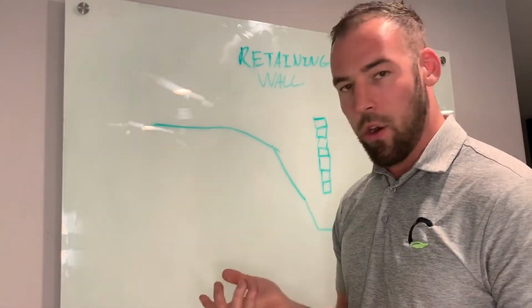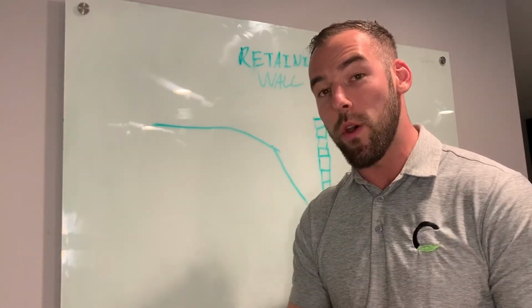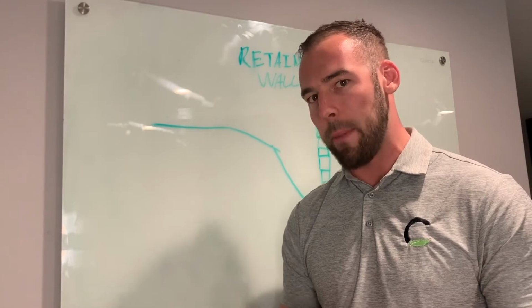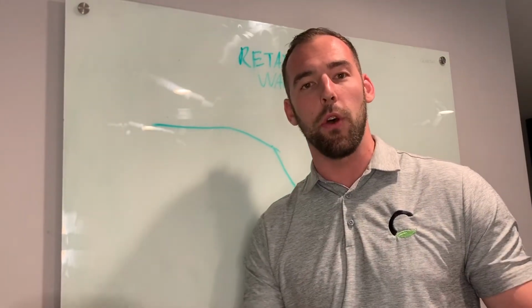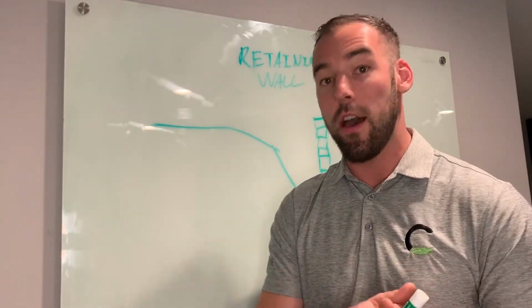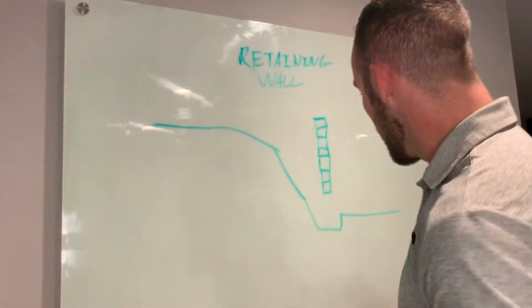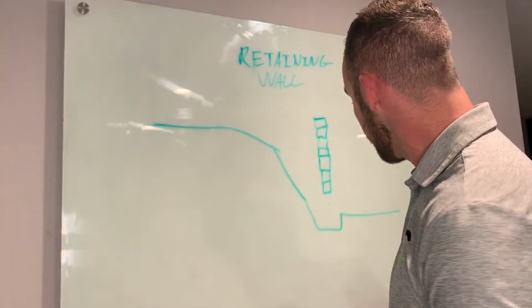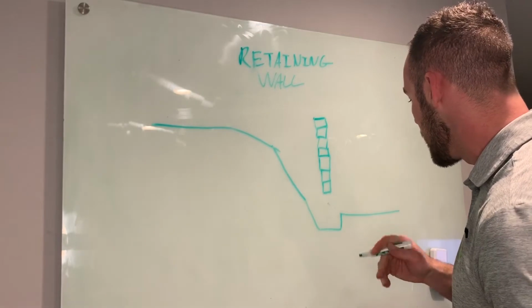Now, in Northwest Indiana, we've got an issue with rain and then snow and then ice. That's why we have potholes in the road, because moisture gets trapped underneath and it doesn't percolate into the soil in time for a freeze. And then there's what's called a freeze-thaw, a frost heave. So the soil heaves and it drops. That's what can happen here if we don't compact this soil properly. So we want to bring a compactor in and smack this down as good as we can.